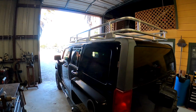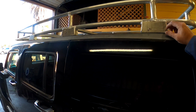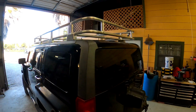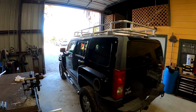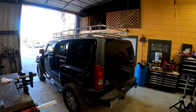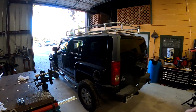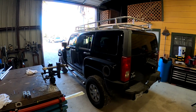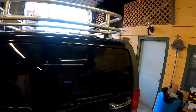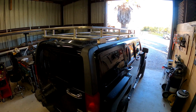So it warped a little bit whenever I welded it. But it didn't warp enough to where I couldn't get the bolts in there and get the nuts started. Once I got the nuts started, it sucked it on down, and then it'll be good. I'll go ahead and tack in the plate on the sides with it bolted down like that. That'll stiffen it up to where hopefully it'll take the warpage out of it from welding it. But there it is.